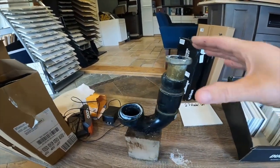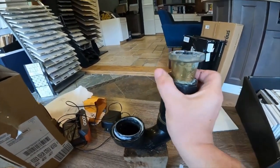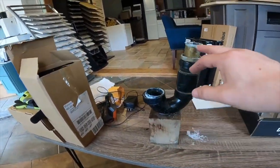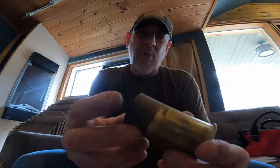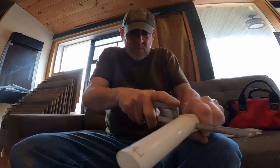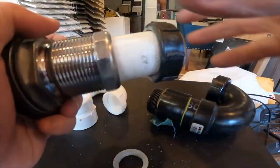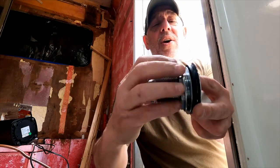We're in the showroom now. This piece is what we just removed from underneath the shower. This part here is called the tailpiece — it slides within this nut assembly. When you loosen this, it's a compression fitting. There's the tailpiece — see how it slides in and out? As you tighten this nut, it tightens the compression fitting, making it harder to slide up and down. Now it's loose.